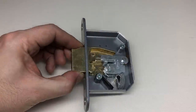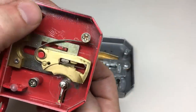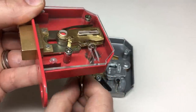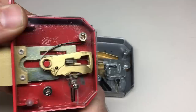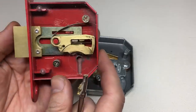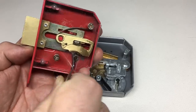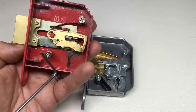So what do we mean by curtained and non-curtained? Well, briefly, if you look at a lock like this, you'll see that this is what we call a non-curtained lever lock. When I put the key in and it acts on the bolt, the key is pulling the bolt across, acting on the talon on the bolt assembly as well as lifting the levers to the correct height using the lever steps on the key. But because the insides of the lock are so exposed, you can tension locks like this just by sticking in a wire — you can see how I've got this wire in the bolt talon and I can get tension on the lever pack with the bolt stump acting on the gating.